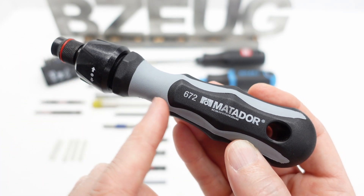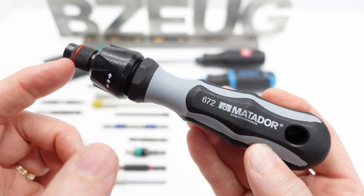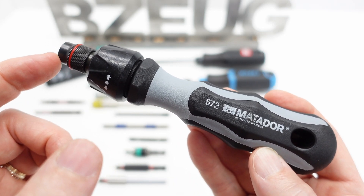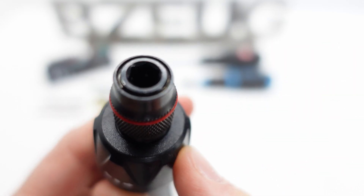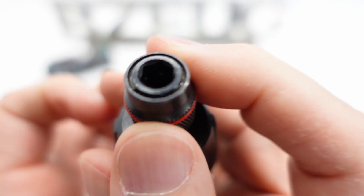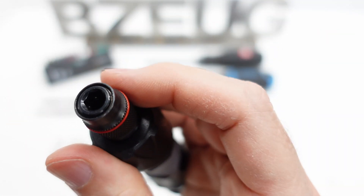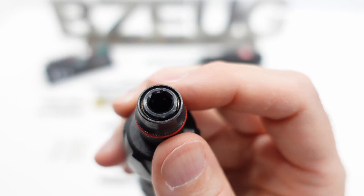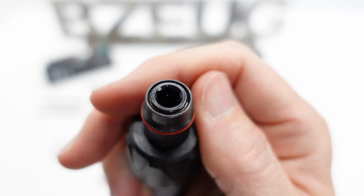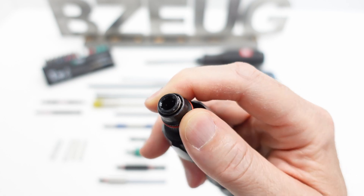It's rock solid. This tool is sold in a set that has blades. There's a long tube in here that goes 110 millimeters from the end of the receiver. Besides the super smooth roll gear style ratchet, the other really interesting distinguishing feature is that they put a locking BB in every corner on the hex.